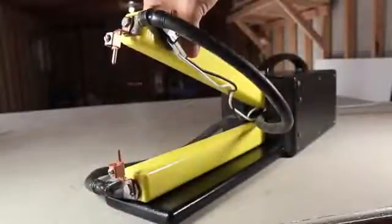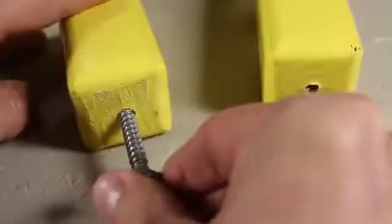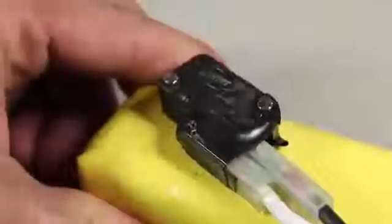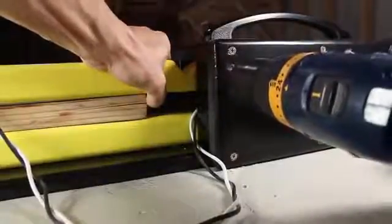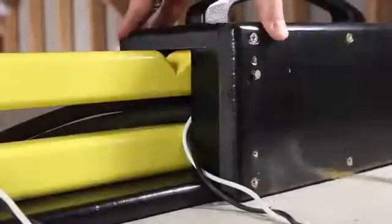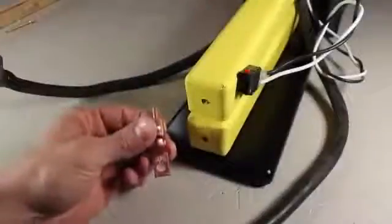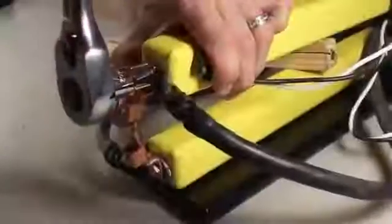The next step is to construct the electrode holders. I chose a 3/16 bit to drill a hole into both tips of the 2x2s — which got painted yellow. The hole is big enough to prevent the wood from splitting when the screws go in, yet small enough to hold them secure. On the top piece, I'm adding a switch to the side about half an inch from the tip, set at a slight angle, with 2 small nails hammered into the holes in the switch. Now the 2 beams are slid into the front of the casing — one under the wire and the other over top. Using scrap wood to keep them an equal distance apart, I drill a hole through the side of the casing and into the beam, then push a nail in so the top piece can pivot freely — that's why we needed that notch near the base. The bottom beam also gets holes drilled on either side with its own nails. The welding tips are attached by pushing a hex screw through the hole in the lug and joining it to the right side cable. Misalignments are fixed by bending the lugs slightly inward, giving us perfect contact.